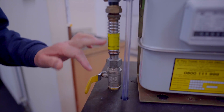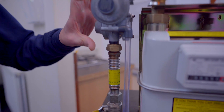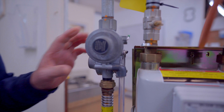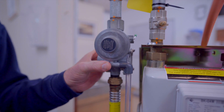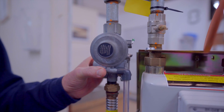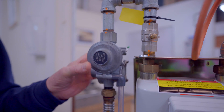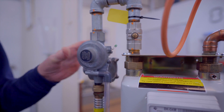Then we move on to the Anaconda with its directional tape, moving into the two-stage regulator. The two-stage regulator covers reducing the pressure from above 75 millibar to two bar, down to our normal low pressure of less than 75 millibar, within the low pressure regulator at the top part of the second stage.